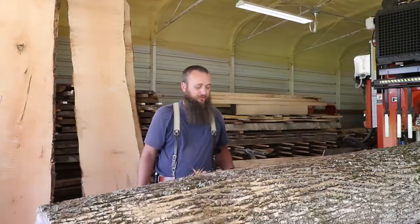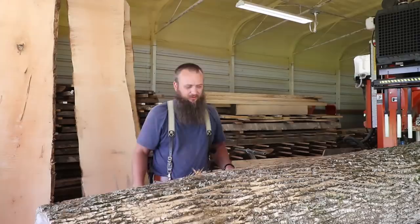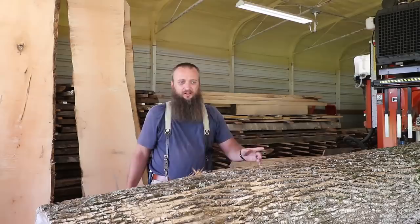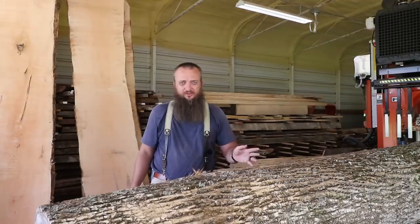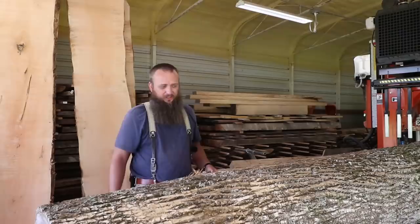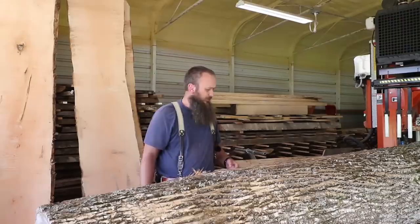You kind of have to figure your losses right there. Sometimes you can also just take those boards and cut them in half. There are so many different variables — you really have to play with this idea and concept to get a good understanding and develop your own method. What I do is put that knot on the side, take a look — if it looks good, I'm good to go; if I don't like what I'm seeing, I'll flip it. Judging by this log it's really clear, and that's one good thing about ash: it grows nice and straight and free of knots most of the time until you start getting up into the canopy. This bulge down here will probably be a problem — I'm going to put it on the outside edge when I turn it toward me and hopefully that will take care of the problem.